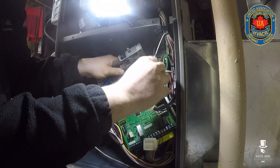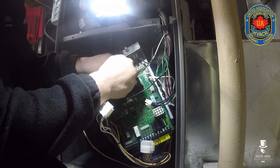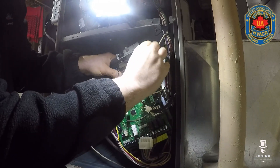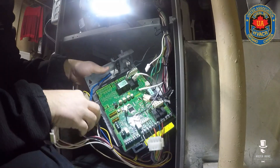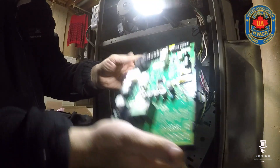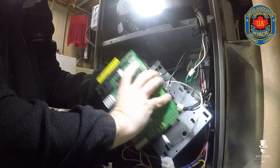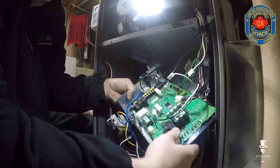Fairly simple — lots of molex plugs. I've got my hotlines, which are all on the L1, and there are these little clips that pop out. The new board is a dash-05; the old one was a dash-03 — thank you, Lennox. It goes in on an angle and should just snap into place like that.